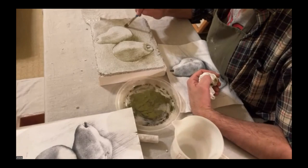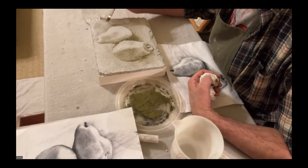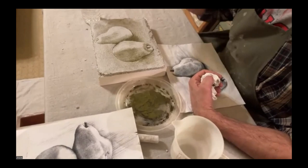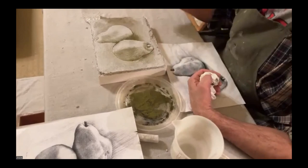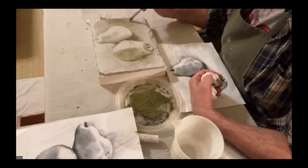Traditionally speaking, you do have what they called lath. In the old days, it was wooden slats, and even before the wooden slats, they used papyrus reeds. In modern times, they used a stainless steel matrix. The design was like scoops. Each individual link was designed to be installed cupped upwards so that it would hold the plaster like a cup. But for the vertical one that I did, I didn't even need any kind of lath because, like I said, with the proper conditioning, with a little bit of a slip coat on the base coat before you apply the cream cheese, it held quite well.